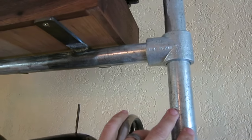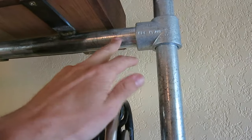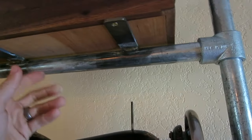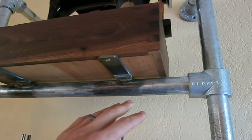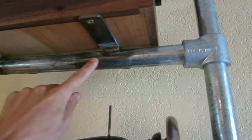This is galvanized pipe. If you are going to be using galvanized pipe, you need to make sure that you sand as much of the coating away as possible, because the fumes as you're welding on it are toxic — you don't want to be breathing that stuff in. This discoloration here is from the heat input, from where I sanded it away.